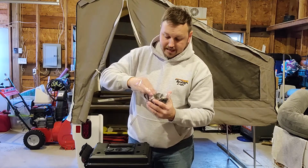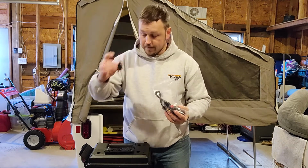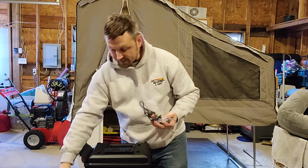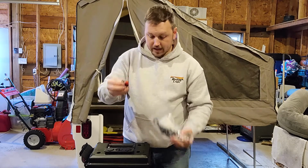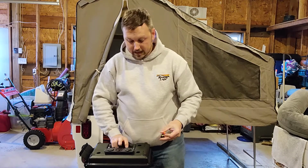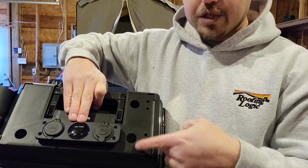By getting the do-it-yourself kit from Ice Hole Power, you get everything besides the wire and the crimp connectors, including the fuse holder, so your system is protected and fused. The individual on-off rocker switches, which are backlit once you have power to them. And banana plug terminals. So this allows you to either plug in a banana plug and open it up, or slide in a spade connector and tighten that down. And those are going to be mounted at this end. So see, here's the holes for the terminals to mount. And then this is the individual switch for each side.